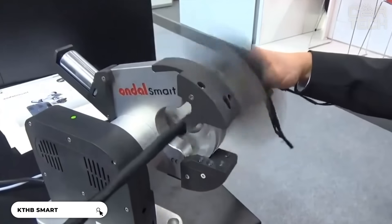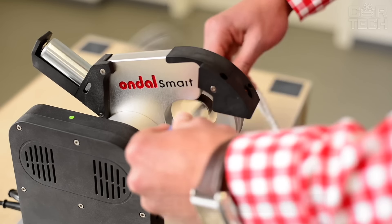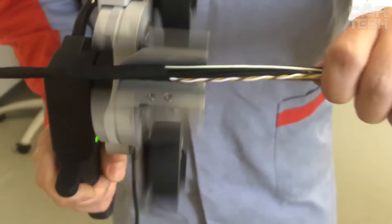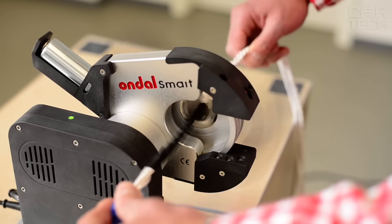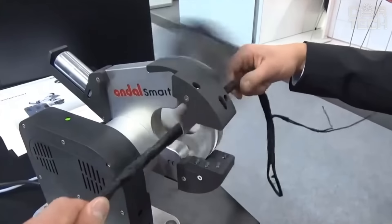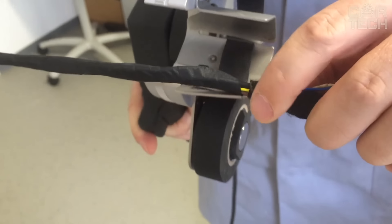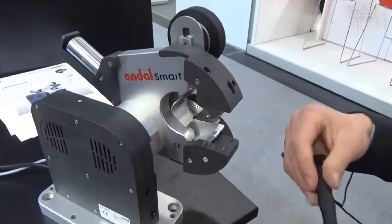The Kabatek KTHB Smart helps to make taping easier and more efficient. The compact, stationary cable wrapping device operates at up to 380 RPM for high productivity. It creates a constant tape tension to ensure a wrinkle-free application, and is capable of handling a variety of tape types and widths. Once the cable is inserted, the machine is controlled by a foot pedal, and an electric brake locks the winding head so that the tape is safely cut using the integrated cutter. It is ideal for producing prototypes and small batches of parts, and can be easily integrated into production or assembly lines. The unit is securely attached to the table and has a small footprint, saving workspace.